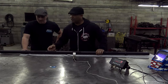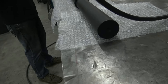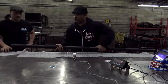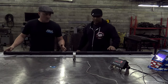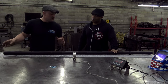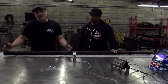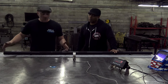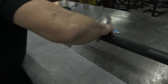Yeah. And you also did something special because the ends of your knurled axle bar are hollow, but as you guys can see, this is not hollow on the ends, right? Does this still have that square core? It still has a square core. This is where we insert the balancing rods, and the two rods are slightly different sizes, and it adds a lot of strength to the bar. We cut the length of rod it takes to balance this bar and to get the weight that it needs on each end. That's how we tune the bar so that the exact center is the exact center.